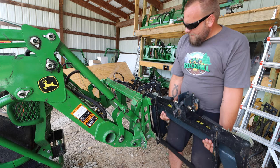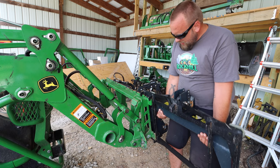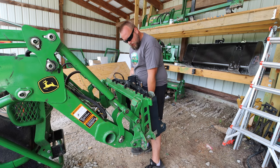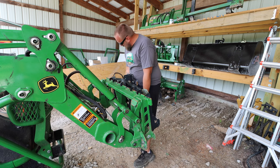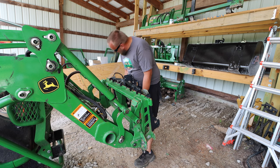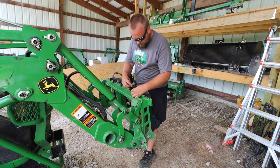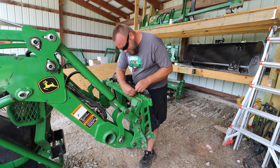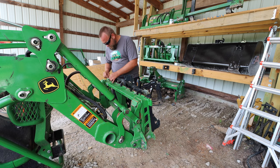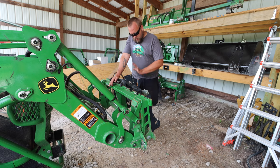Now I'm doing it a different way than I have before. Normally I put this plate on first and then put on the quick hitch. I just decided to see if it was going to be easier or more difficult to put it all together at once. It was heavier to do it this way, but it was quicker. And just like that, I can now run any type of three-point attachment I want on the front — or carry it. I don't have a setup to run the bush hog up here; it's just to carry it.